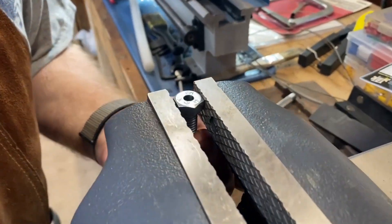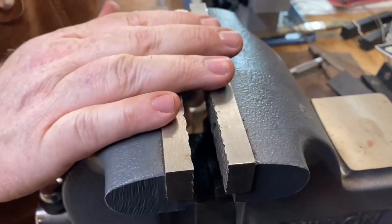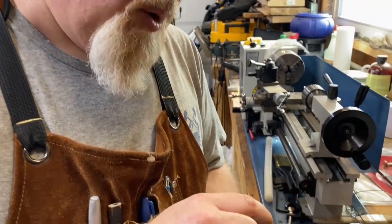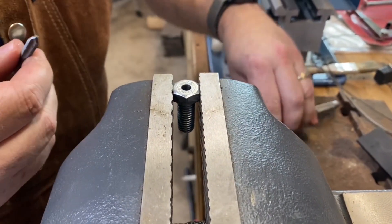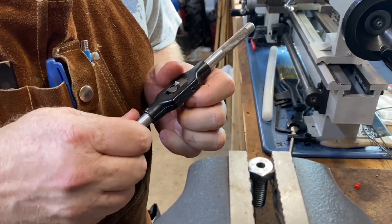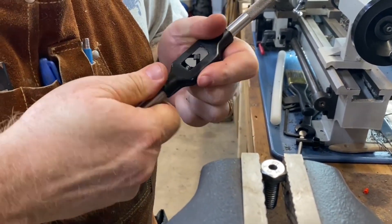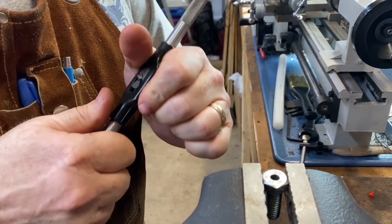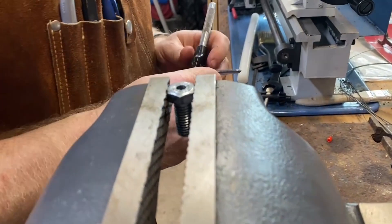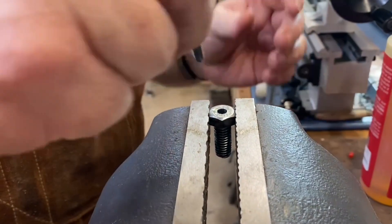We're going to take the head of our bolt and put it right in the vise. A heavy duty vise is almost a must around the workshop — I've had this one for four years and I'll probably do a review on it one day. We've got our bolt locked in and our quarter by 28 tap — that's the type used for grease fittings — loaded into our tap holder. We need a little bit of lubricant up top, some Tap Magic. Not a paid promo — just a little bit there to get started.